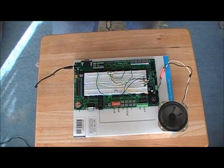It only has 8 spots in its playback loop and its default loop. There is only so much space on the Basic Stamp 2 for programming and RAM. There are 3 words taken up for your ins, your outs, and your DIRs. Then you have, I think, 13 words after that of variable space to work with. I ended up only being able to use 8 spaces, 8 words in the variable space. Hopefully I will improve upon this later.